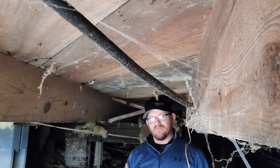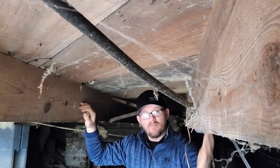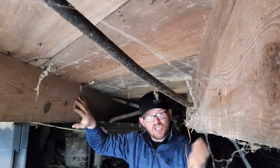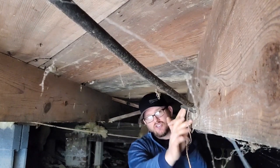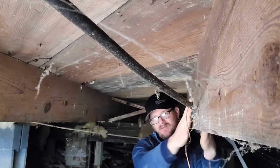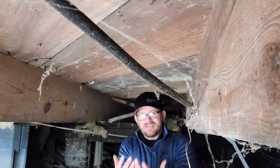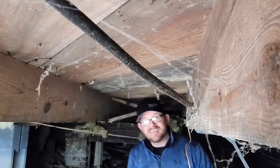One of the major things to watch out for if you have to drill holes through the studs is: before you drill that hole, make sure you reach on both sides of that floor joist. Make sure you're not going to drill into something. It's very easy when you get rocking and rolling going down through there, but you have to check both sides. Because if you're on this side drilling this way, you may not see what's on the other side — as you can tell in the video, it's only about two to four inches up. So make sure before you drill, you reach on both sides of the stud. It's embarrassing to hit an electrical line, it's a disaster to hit a plumbing line, and it's a disaster to hit an HVAC compression line.